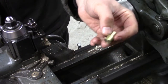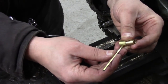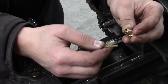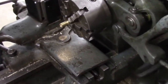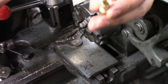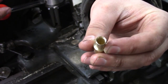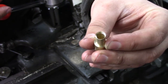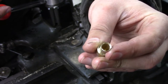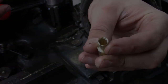Hole down the middle. Next we'll put a hole in here in the middle to intersect that. Make it the same size as to slip on top of that 3/8 venturi piece we made. So I forgot one little detail that I just rectified here. This needs a little shoulder in there to hold the flame holder, a piece of screen. So that's about 348 thousandths diameter by about a 16th of an inch deep.